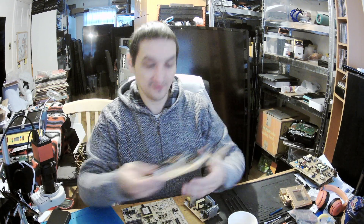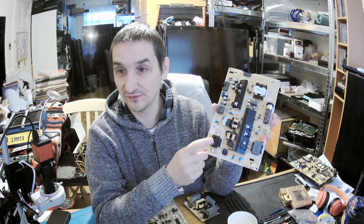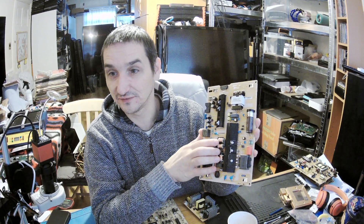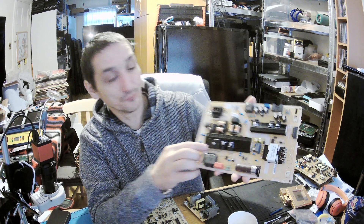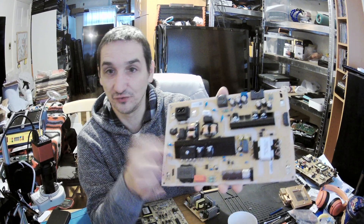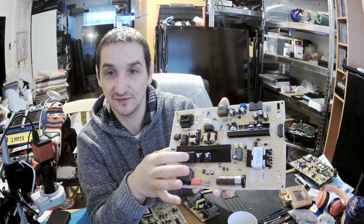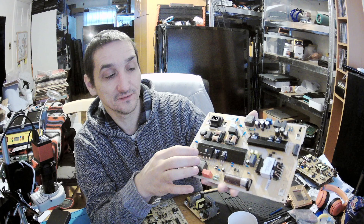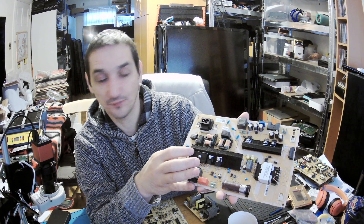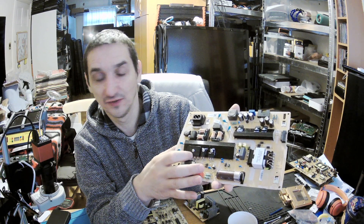Two more from TVs — look, I took them as random as I could, not the same ones. So you've got a different input, but look — a double coil, for the phase and the neutral. You've got a big bulky bridge rectifier — not individual diodes this time, so it's different. But there are still four diodes in the same package. The cut shape is the positive plus, and the opposite side is the negative, and inside those two pins are the AC coming in.